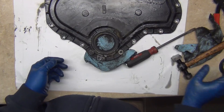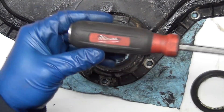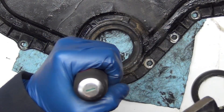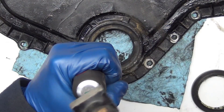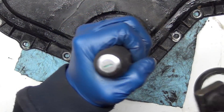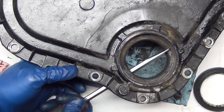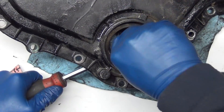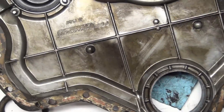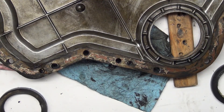This is how to replace the crankshaft seal or timing seal on the front end — and the back end in the case of a forklift. I've got a big flat-head screwdriver that spans the whole thing with a metal back. Just knock it down in a couple of places — this bends it and kind of folds it like a taco, making it come out a lot easier. Be careful not to scratch the sides. Once you've bottomed out, lift it and go from the other side — push on the screwdriver, not the timing cover — and it'll pop right out. I've got a wood block about the same height as the distributor pump assembly to stick across the back to prevent teeter-tottering.